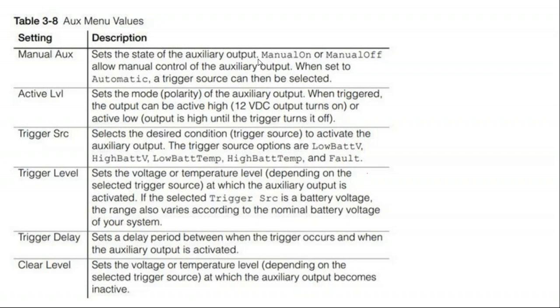And what we're seeing are these trigger options. You can run different relays coming off the battery inverter based off a low battery state of charge. Off a low battery state of charge, you might want to shed load, to turn loads off. There's also high battery state of charge. When your battery is completely full of energy, you might want to run a water fountain out in a pond, and when the battery is not full of energy, you might want to turn that fountain off. Have a nice visual signal built into the facility that says my battery's at a healthy state of charge. What electricity is decorative? What electricity is superfluous? You might have those loads running at a full state of charge and other loads running not so.